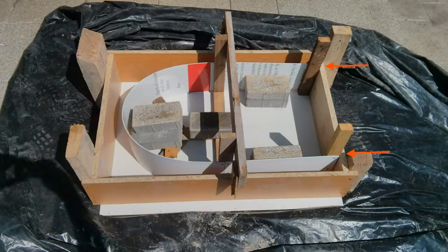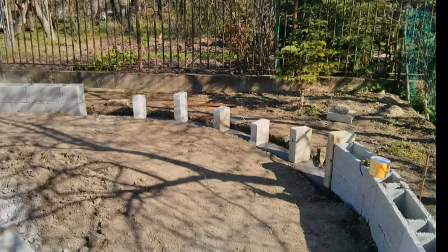The top and bottom ends are screwed into the lumber posts from the inside, and the sides are screwed in from the outside. The arch shape is secured at the bottom with screws from the outside, and the plastic is also screwed into the posts. The long horizontal wood in the middle is a handle for lifting. To demold: first unscrew the sides, then the top comes off. Next, unscrew the arch from the bottom. I use a post to bend the plastic inward so it separates from the concrete, then gently lift the entire middle section out. The two posts are slightly angled so the arch is tapered, which helps the plastic arch separate cleanly.